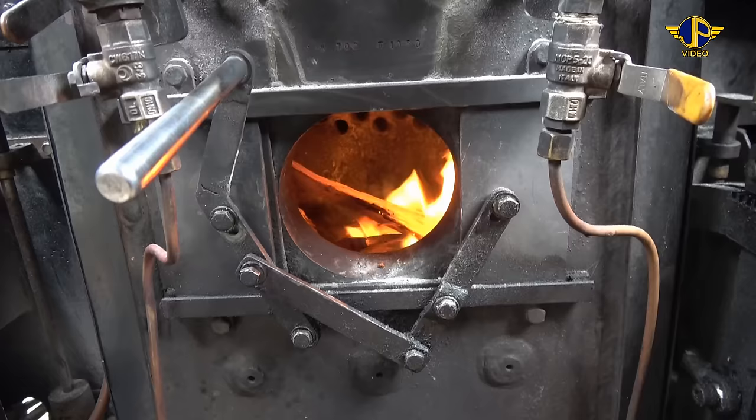Okay, when we're generating heat in the boiler that's generating the steam out of the water, there's a water current flow within the boiler itself called a convection current. Because the firebox is hot, it's drawing the colder water back from it, and it's heating up the water, and that hot water then is flowing away through a convection current of hot water and cold water circulating inside the boiler. And we can see the water circulation with the movement of the water inside the gauge glass.